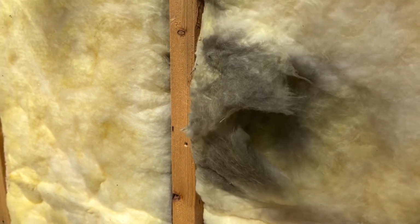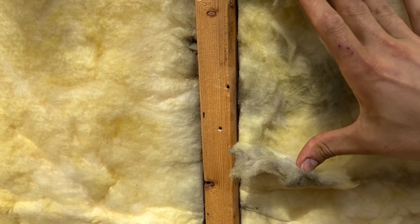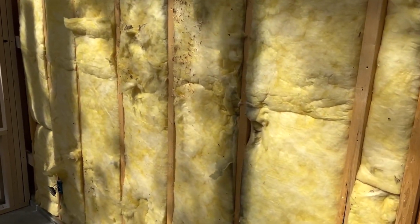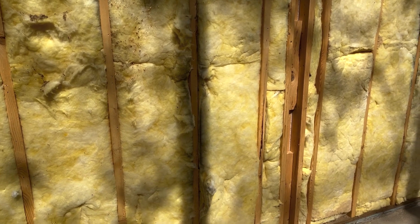It's not brown or dark, just that surface layer there, because it's acting as your air filter for your home. All the sheeting that we pulled off was a different type than we use. We use zip sheeting, which has a water and vapor barrier built on the outside of it, and we tape all the seams so air cannot get in through that sheeting.